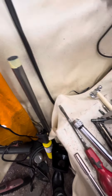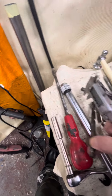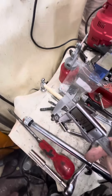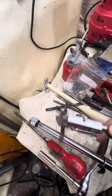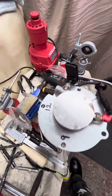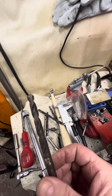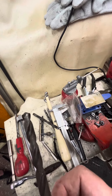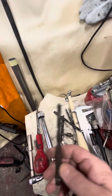Okay, that's a 9mm. So you really want to approach 9.25mm. I think that's an old imperial drill at 9.44, but that's perfect — absolutely perfect. You also want to mark it with a marker pen to start with. You don't want to go up to 9.5mm — if you go up to 9.5mm, you're going to have hardly any thread in there at all, because you've only got to wiggle it slightly and the hole's too big. So do it at 9.25mm, then start cutting your thread.